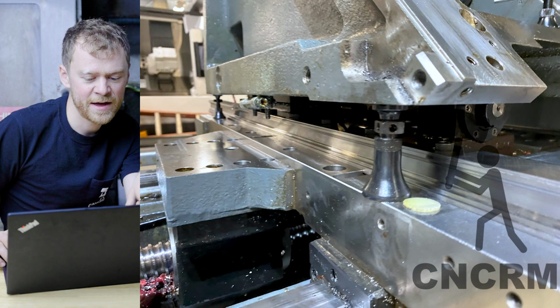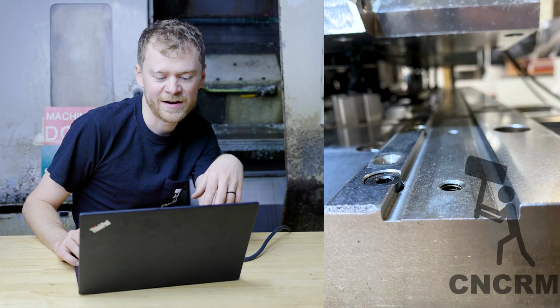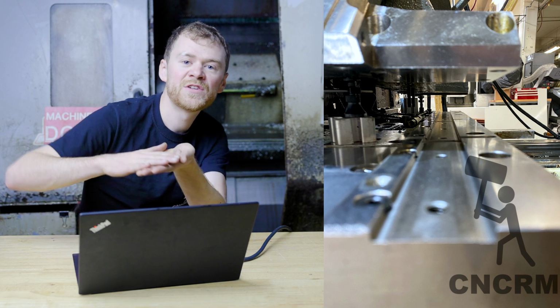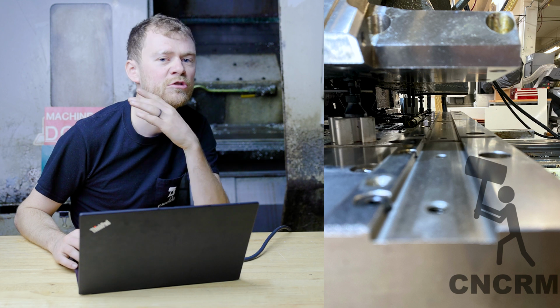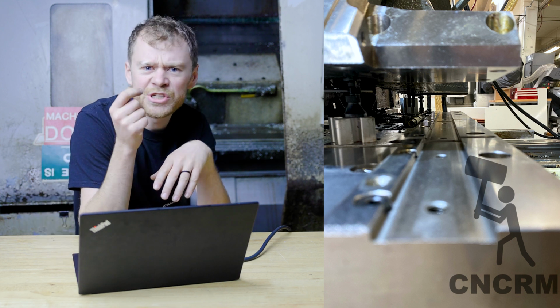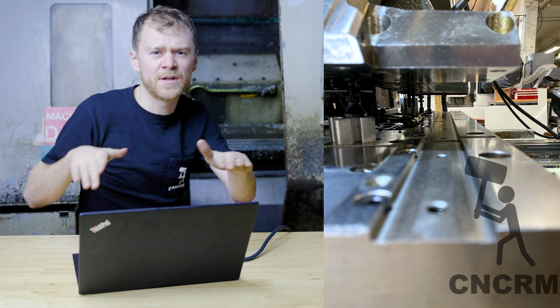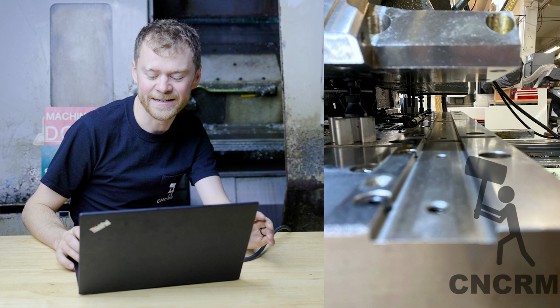There you can see the new rail. I've got the jacks holding it up. Here's the other one, getting ready to slide it in. Good and clean, everything. Stone the surface above that the truck is gonna sit to while you're in there so that there's nothing dirty. One hair, one chip, garbage. If it gets on there, now everything is crooked, everything is not aligned. You're gonna have issues with alignment, so everything has to be clean.